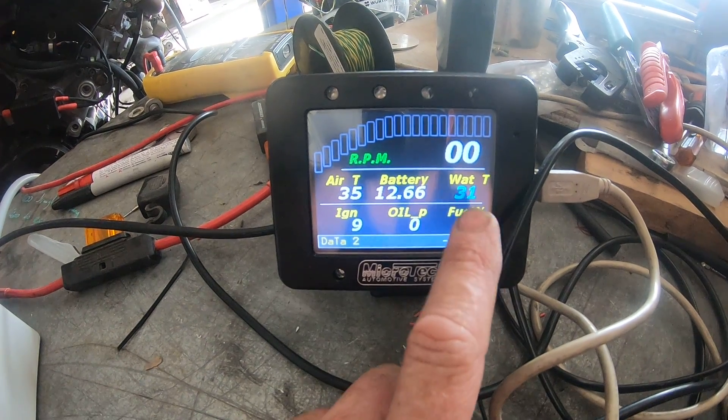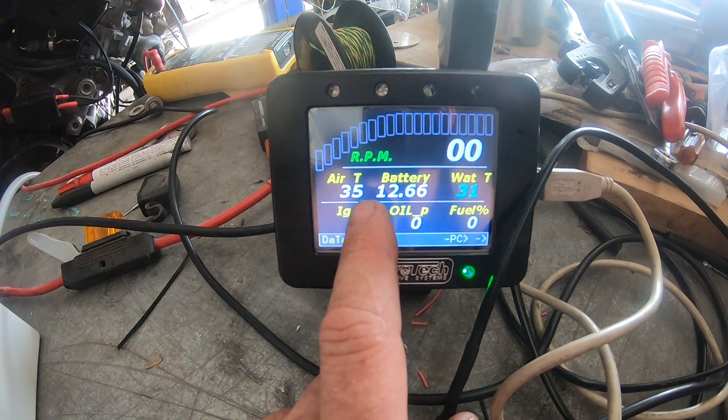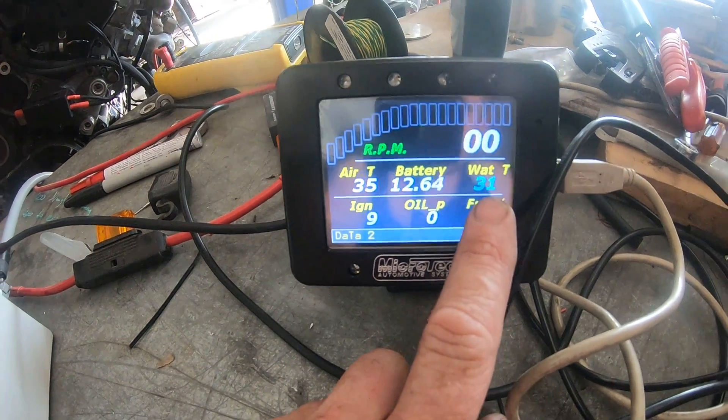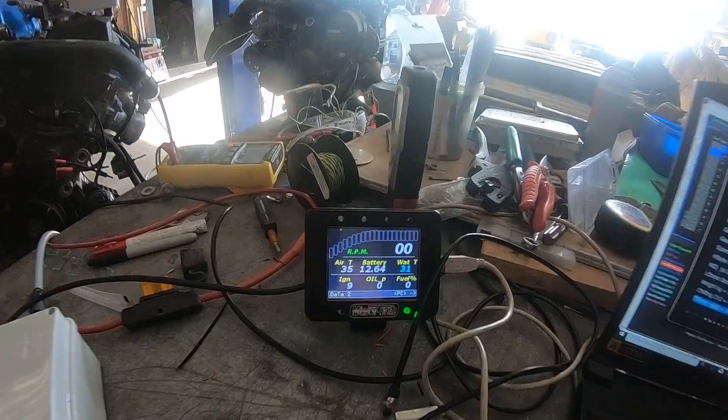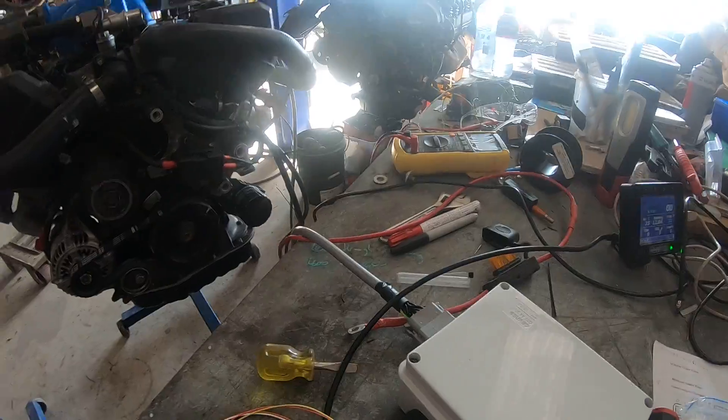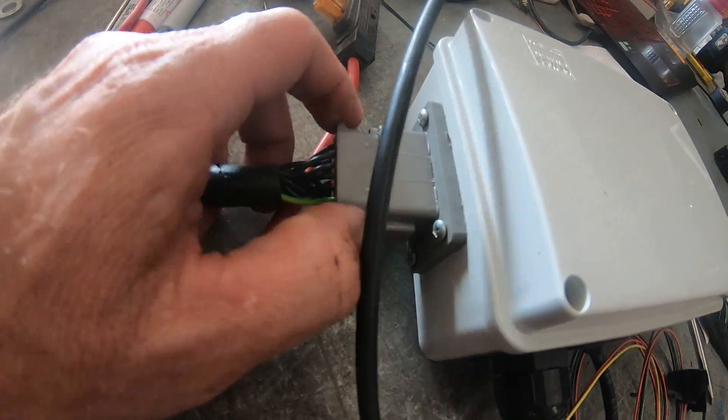Can you see how hot it is in here today — air temp of 35 degrees, taking a little bit extra to warm the water up. You can see it's showing a different color indicating it's cold — that's the warning color, and it will show that color until it gets up to the correct temperature. This box is connected via a big 12-pin plug. I knew I was pushing the limits running my CAN communication through that cable, but it's worked — there were a couple of funny numbers in the setup I'd forgotten about, but I've got it done and it's working.